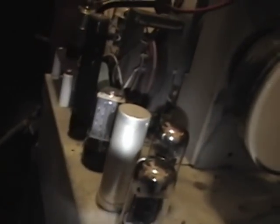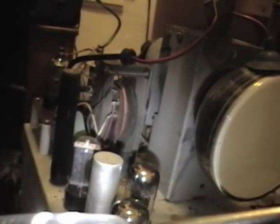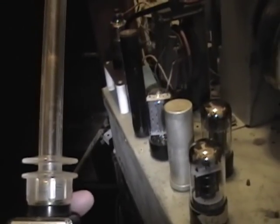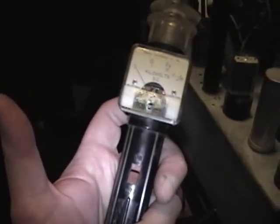Inside the clear plastic of the probe, there are two candy-stripe resistors — super high resistance resistors. In this case, there are two 720 megaohm resistors, so we're looking at 1.4 gigaohms of resistance total. What you do is carefully put the probe either under the metal cap or up on the ring, flip the on button, and read the high voltage. I'm not going to do that right now, but I thought I'd point that out.